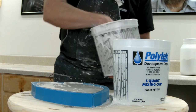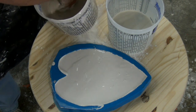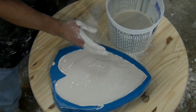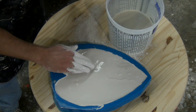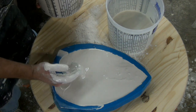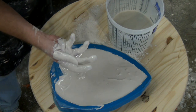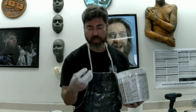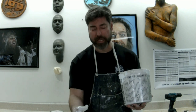This is a silicone mold, so when I'm casting into a silicone mold I do not need any kind of mold release. This will pop out of here just like ice out of an ice tray, no problem at all. HydroCal will have hardly any effect on the lifespan of a silicone mold. Now, if this is a polyurethane mold — if it's 74 series — typically most of our 74 series rubber materials don't require a mold release either. But be aware: as soon as you start adding modified gypsums or acrylic modifiers, that will make it a lot more aggressive and really grab onto the mold. That's where you really do see a difference between silicone and polyurethane rubber.